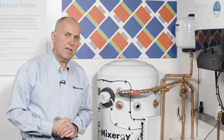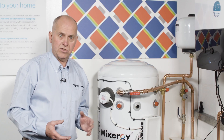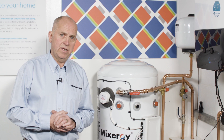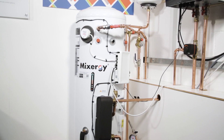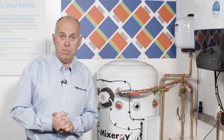Now we're going to talk about control and the techniques used to operate this system. We'll look at the resistor switch, which is important for the heat pump, and the internet connectivity. The Mixergy cylinder has a clever resistor switch wired directly to the heat pump, with adjustable potentiometers to enable it to be set up for each and every model of heat pump available. The two resistance settings for the Daikin Altherma high temperature are 25k ohms high-on and 4k ohms high-off. To the heat pump, the system looks like a normal thermistor shipped with the product. Mixergy will provide you with the resistance values needed for the particular heat pump model you're working with.